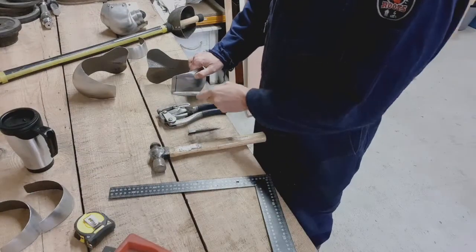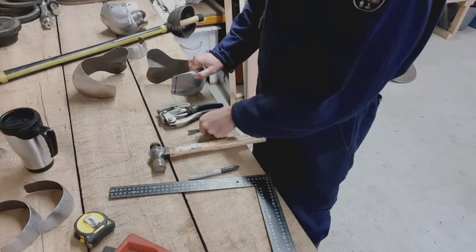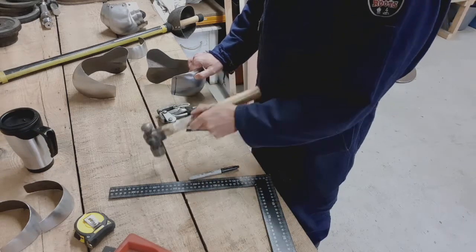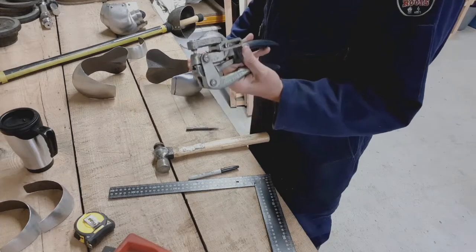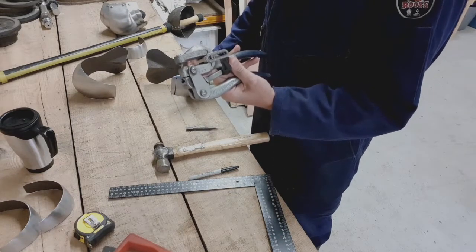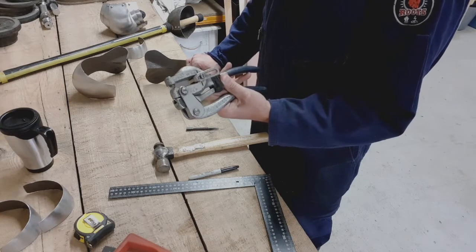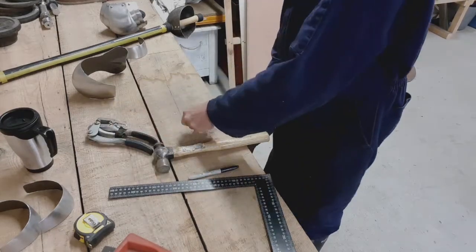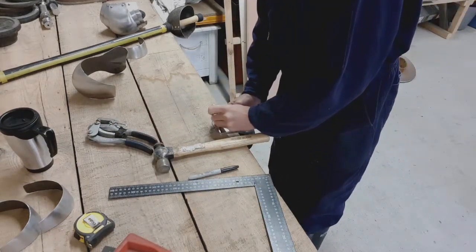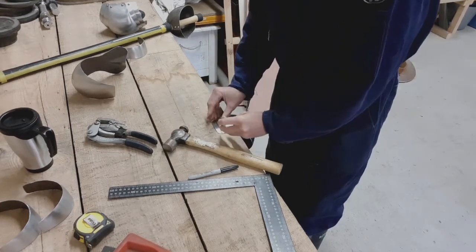So here we can see we've got one knee cop with 2 points marked on it to punch, 1 centre punch, 1 hammer, and 1 absolutely fabulous Roper Whitney punch, which is an essential tool for anybody punching holes in steel, in my humble opinion. So firstly, centre punch. Put it on the bench, sight my punch, tap with hammer.